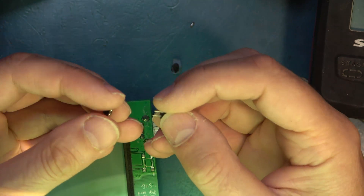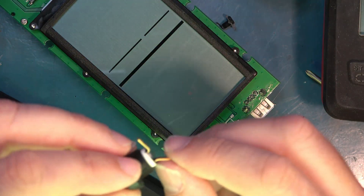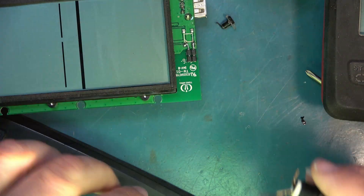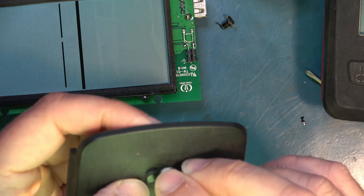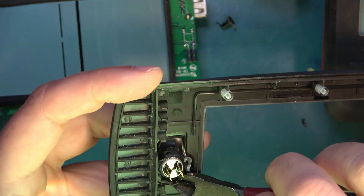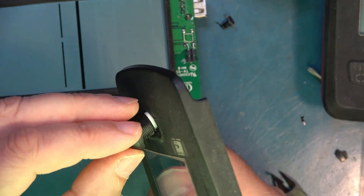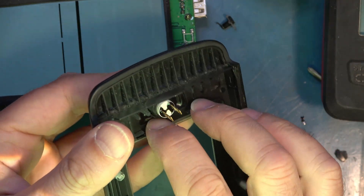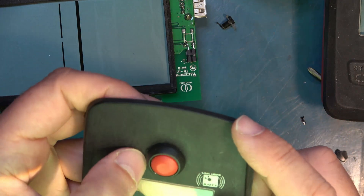Be careful — not all of this kind of socket has round pins; some have square pins and those would not fit into themselves. We're going to have to bend these tags over to clear the board, but first we need to mount the switch in the housing. You may need to open out some of the damage to make room. I've cleared out material on the inside of the broken hole so the switch fits cleanly through and there's not too much broken plastic in the way of the threads.